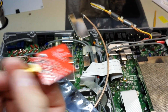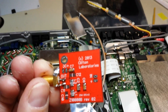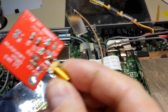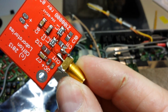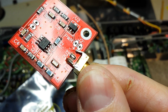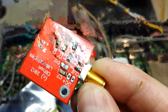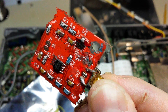I've already tapped my own Pro 3 — this was actually my father's, and I was tapping his. I prefer SMA connectors because they're smaller and easier to deal with, but the mounts I've seen aren't small enough to fit the hole pattern, so I had to modify a board-mount style SMA to fit. Make sure the center pin goes to the positive and the shielding goes to the negative.